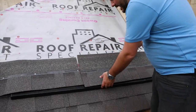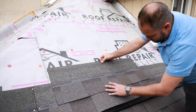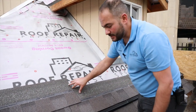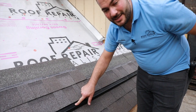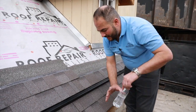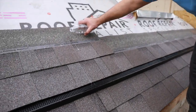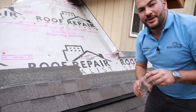We've completed installing the inflow vent. After this point it's just like installing any other roof — the shingle will get aligned with the proper pattern and we'll continue installing. This top layer is already past the inflow vent so we can use regular nails. Now some people may be concerned about this opening and how it may cause a leak — that's why we layered it up and have this shingle going underneath. If you have water coming into this cavity, the water actually flows underneath the intake vent and flows out. The same thing with water coming here — it will flow over the shingles and whatever comes in will flow out. So you have no concerns.